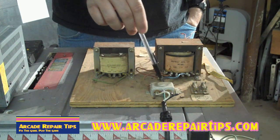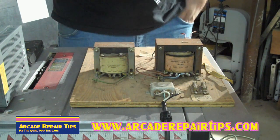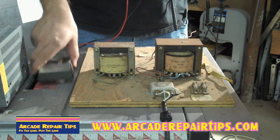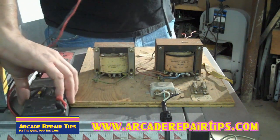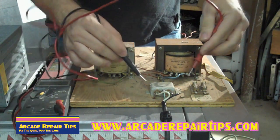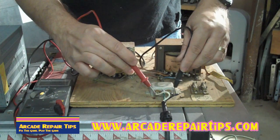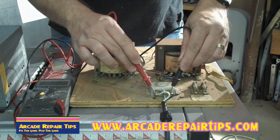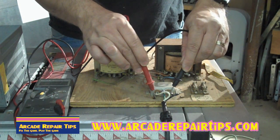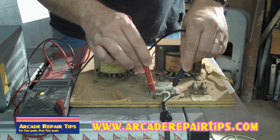Even when you buy a new one, this is a good thing to have. This AC filter right here will come in — you'll have 120 here. The first thing we want to do is measure our voltage coming from the wall. You'll measure these outside leads right here. On ours it's black and white — one is your line and neutral and the green is your ground. There's our 120 right there, 116.5, which is real close.